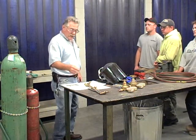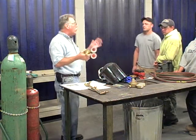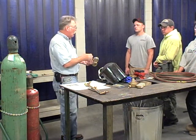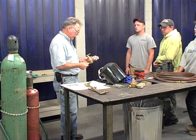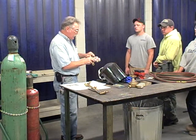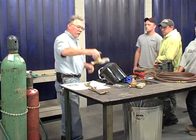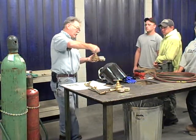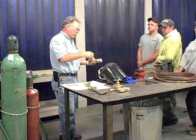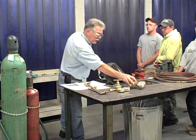Then you want to inspect your gauges. Look everything over. Check out all your equipment. Make sure things look good here, clean. Remember we talked about no oil on here, no oily surfaces, so you don't even really want to run your fingers on it. Have a little rag. Make sure that the lens covers are on. Make sure the regulator goes to the off position, which is when it's spinning freely, going out. Lens cover's good, needle valves look good. So inspect your gauges.